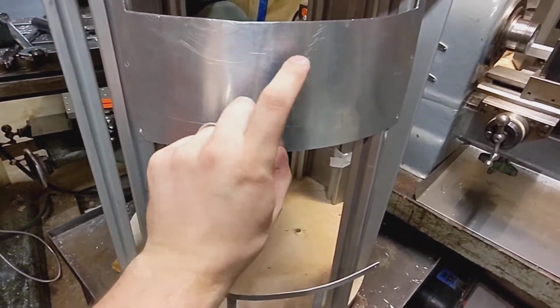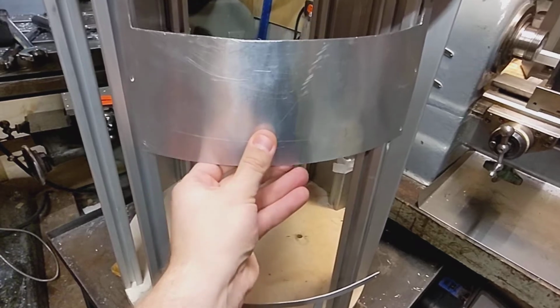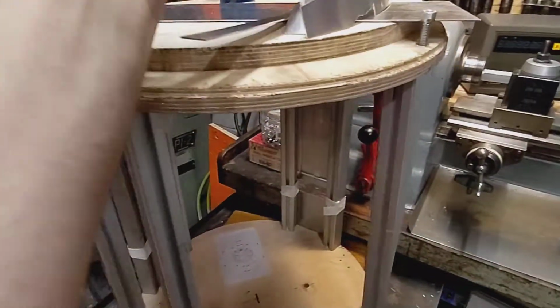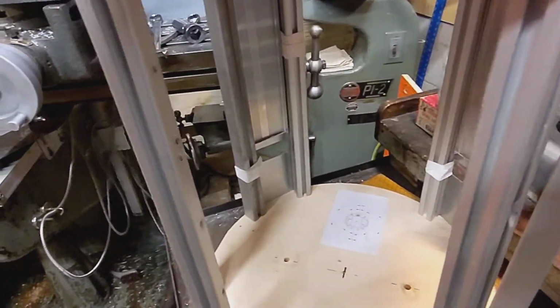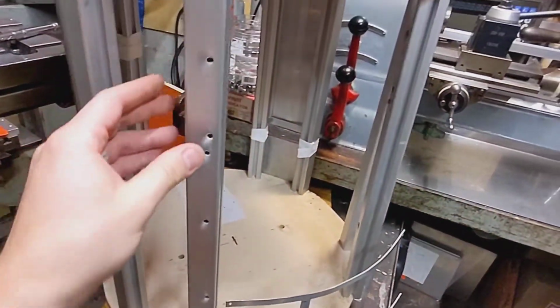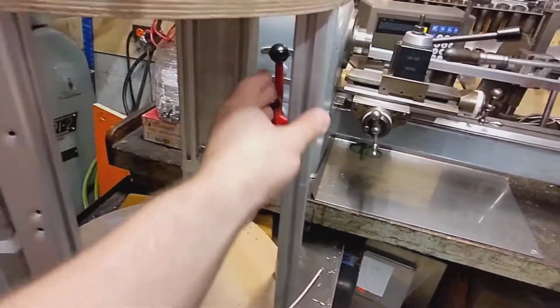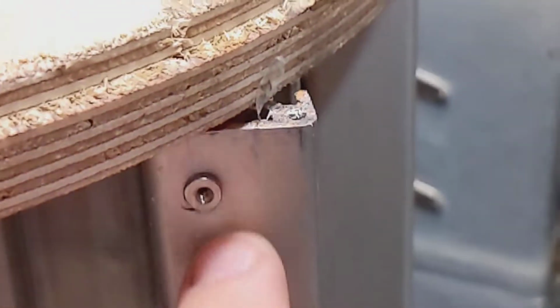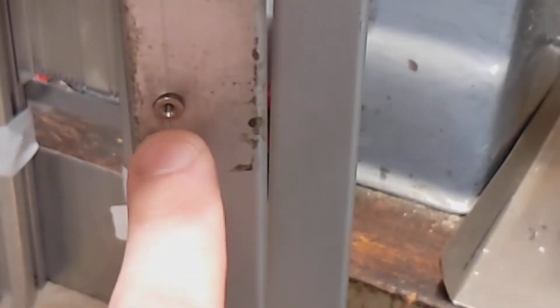hands, because this is going to get complicated. And I started figuring out how am I going to mount this sheet metal pieces to this extrusion? And I'd hoped to do flat side out, and I attempted a couple of, these are PEMs, and that PEM insert, what I did was I just squeezed it. I squozed them, and I crushed some of the extrusion on the inside doing that.